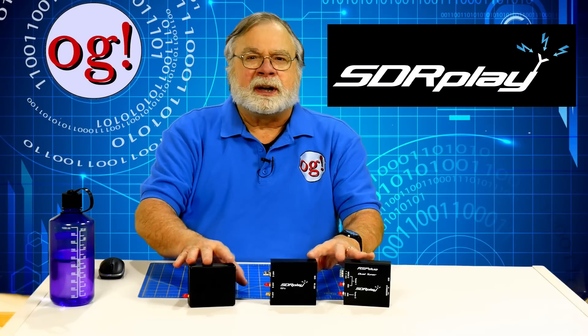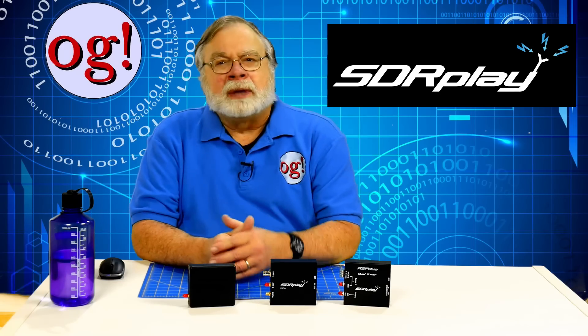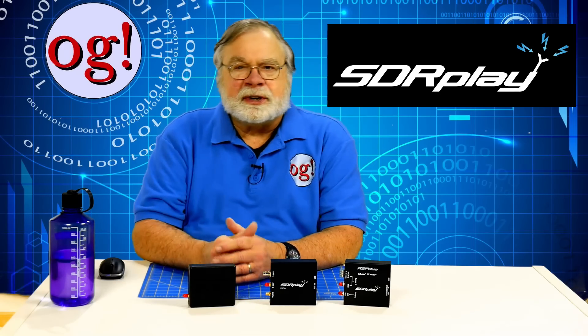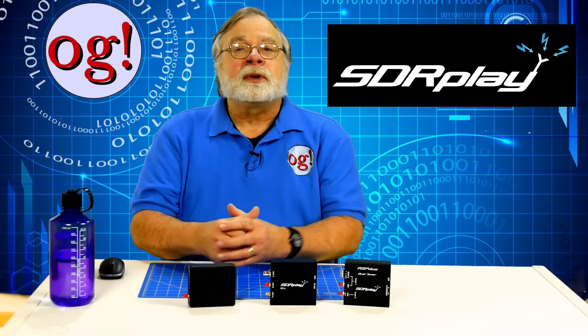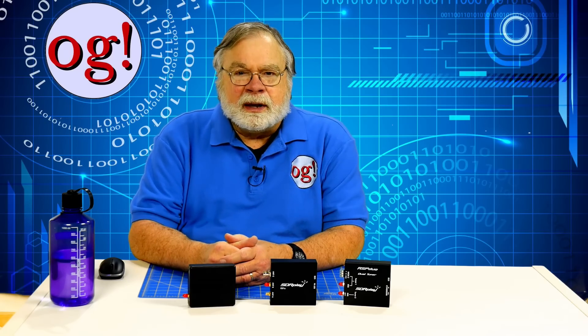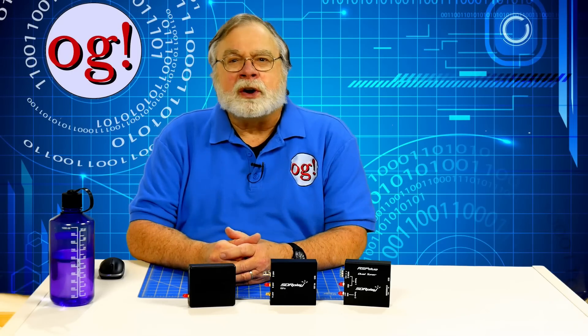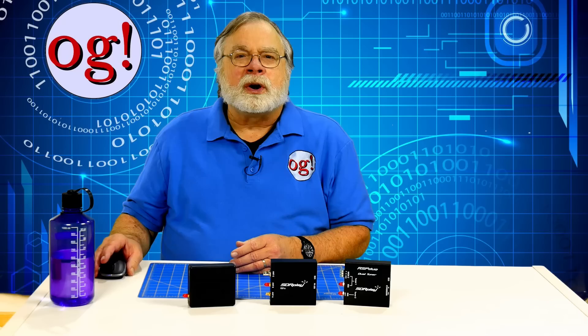There are more expensive USB-connected black boxes that can do some pretty amazing things. The SDR Play series of receivers, even though they look like black boxes and are attached to your PC via USB, can provide truly amazing performance, rivaling even expensive ham radio transceivers. It must be remembered that these are only receivers, or as SDR Play calls them, radio signal processors. There are three radio signal processors, or RSPs, in the SDR Play line — I have all three of them in front of me.